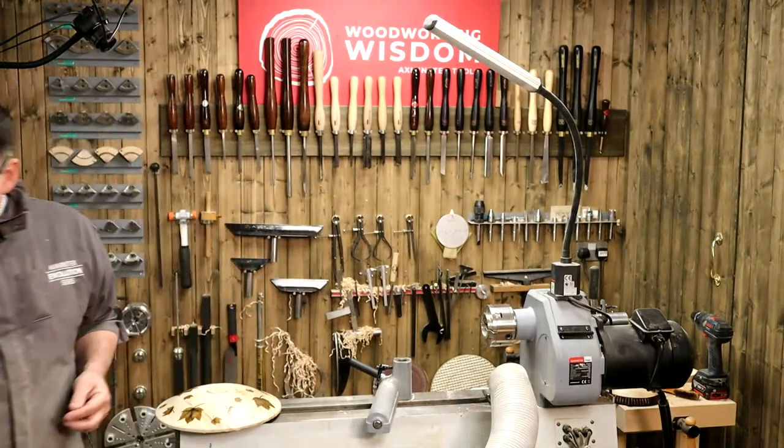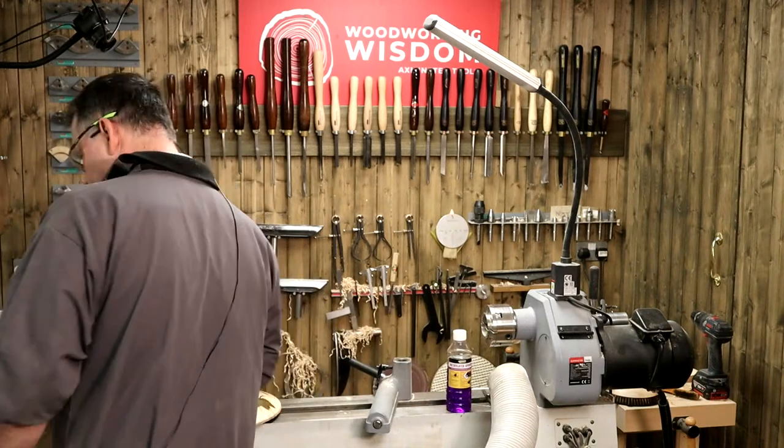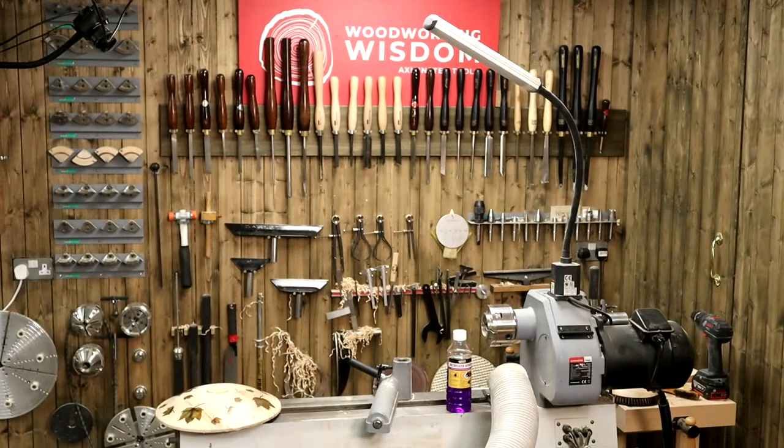Was the wood sealed in any way to help stop the bleeding? No, I just sanded to 600 grit, Brian. Because I sanded so fine, it creates almost, I wouldn't say an impenetrable barrier, but it means that it's harder for the stain to soak in. Bear that in mind if you want to dye pieces to then sand back. The stain won't penetrate too far if you sand too fine.